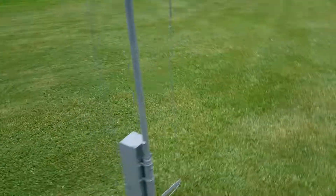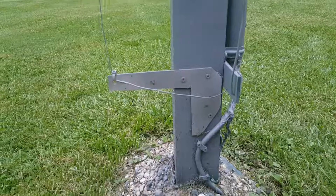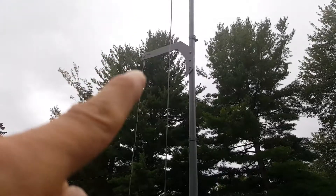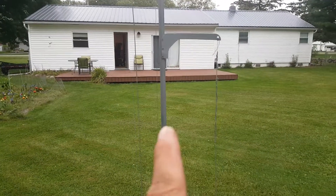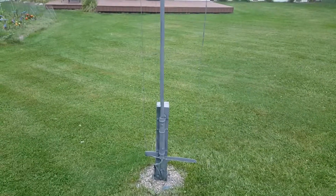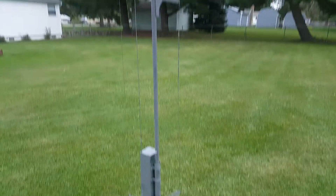So I figured I needed 10 meters, and on goes another wire, another piece of scrap plastic. Right here is the 10-meter radiator, the 15-meter radiator, the 6-meter radiator, and 20 meters. I especially expected a lot of interaction on 15 when I added the 10-meter wire, and again there was very little — almost none. Same when I added the 6-meter radiator.